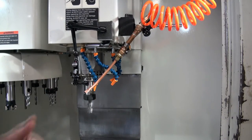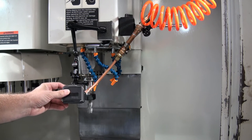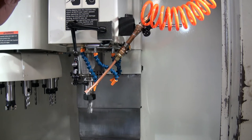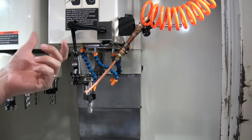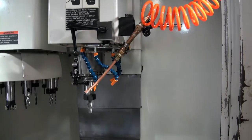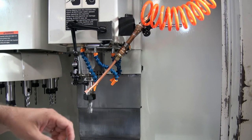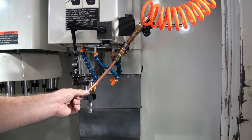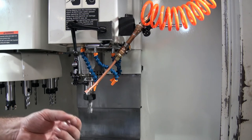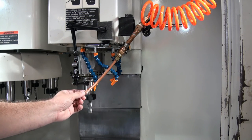I'm using Rain-X on the lens of the GoPro, and now I came up with this setup here. The GoPro would normally be mounted right here checking out the action at the cutting surface. I kind of cobbled together a bunch of stuff this morning that I had laying around the house just to try this out. The only thing I actually went out and bought is one of these little slinky hoses, just so that the Z can go up and down freely. Then I got a couple of plumbing parts pasted together, and this is just a piece of three-eighths copper piping. I gradually crimped the tip down, then I took a piece of 20-thou shim stock, put it in the tip, and crushed it really hard with my vise — so I've got a nice 20-thou wide slit in the very tip.